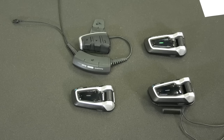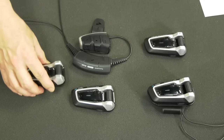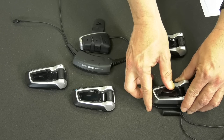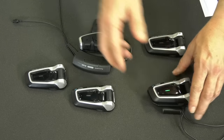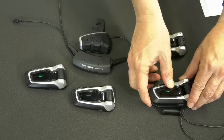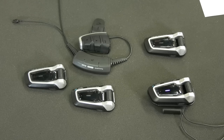To change the group — perhaps add a few members — remember that admin unit. Activate grouping on both the new unit and the admin by pressing the intercom button for five seconds or until you hear the third beep. When grouping mode is activated, press the intercom button only on the admin unit. Wait a few seconds for the two units to group. Congratulations — you just increased your group from four to five.